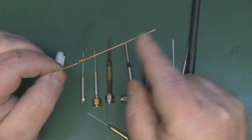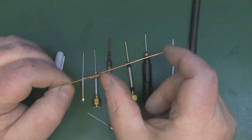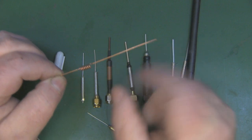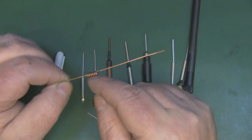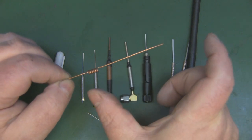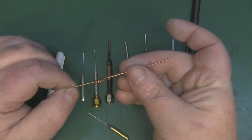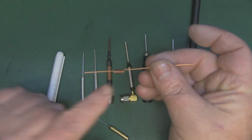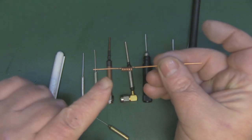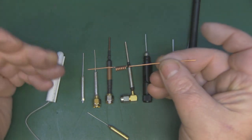Now, this here is 60 millimeters long. This is one full wavelength at 2.4 gigahertz, but because we've got this loading coil here, we've been able to shorten that by half, bring the length of the antenna down, and still it will work at one wavelength long. Here, this is 25 millimeters, or it will be when it's cut off and attached to a proper dipole antenna